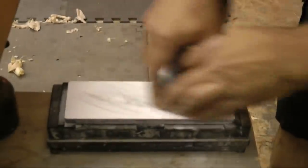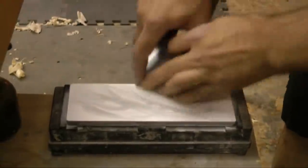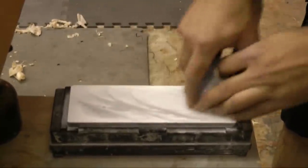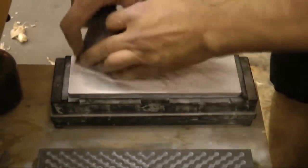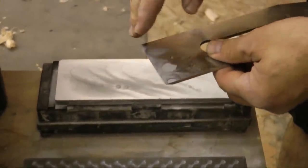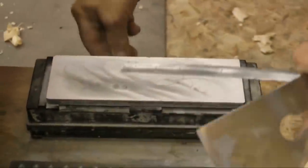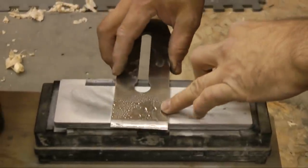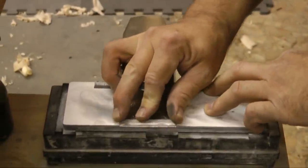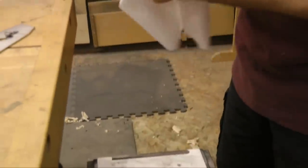After 10 seconds I'll treat the two outside corners — putting downward pressure on one corner for about three seconds, then the opposite corner for three seconds. That creates a light feathering effect on the outside corners and prevents plane tracks when doing a large panel. Then I set the steel rule down — this is the Charlesworth ruler trick — and lay the blade down working within a quarter inch of the opposite edge to remove any remaining burr.